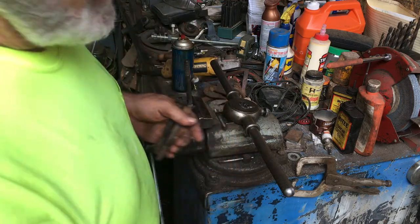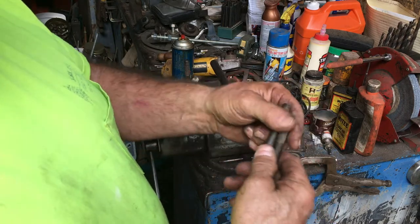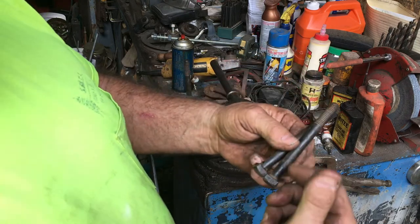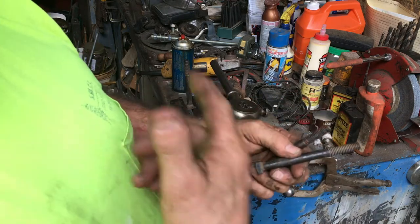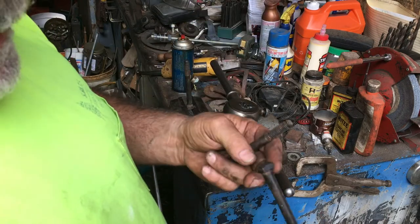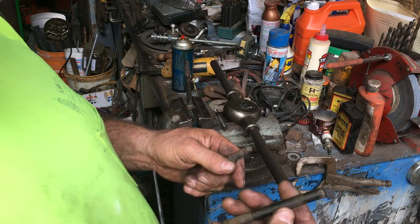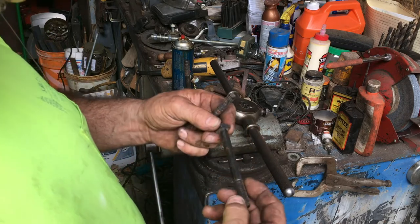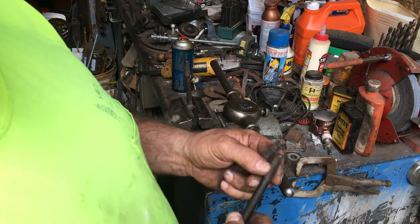So what I done, I come back in the shop, and I got to digging around some of the old boxes out of the blacksmith shop from the old man's plant back on the farm, you know, and come up with some bolts long enough where I'm gonna cut threads on them all the way down as far as I can, and that's gonna give me my roughly 3 7/8 inches what I need in order to make this a success. So it's gonna be harder than a grade two. These are old bolts. Hell, they're square head. Hell, they're probably close to 100 years old, or probably at least 80, 90 years old. And at any rate, they're good enough quality where they're gonna suffice.